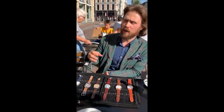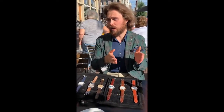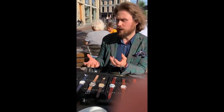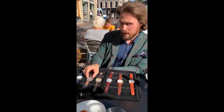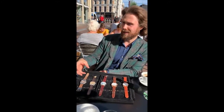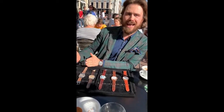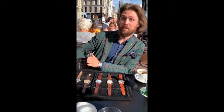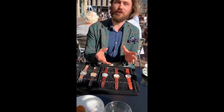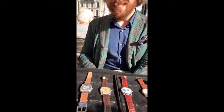Using a very new production method combined with very traditional finishing is actually quite fascinating. When I started reading about watchmakers' opinions on 3D printing, two things came up: one, they don't believe you can get something useful out of it because it's too rough compared to traditional machining. If you make the exact same thing on a traditional machine versus a 3D printer, you can't compare them. But if you use it as a design feature — an extension of what's possible within your designs or finishing — then it's very interesting and adds to all the opportunities.